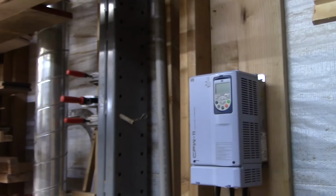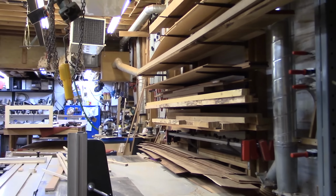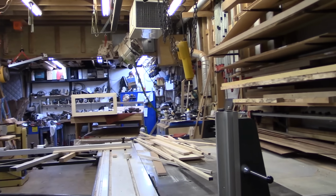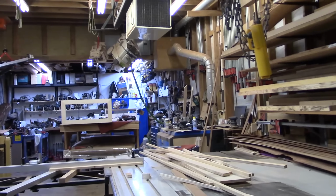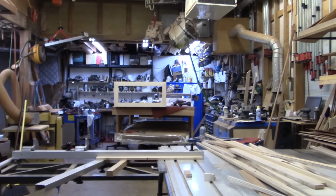Now, how much of this stuff is three-phase? Everything? The big industrial equipment is three-phase. And for the small shop owner, learn to set yourself up with a rotary three-phase, because you can generally find three-phase equipment cheap because the normal guy doesn't want to buy it.